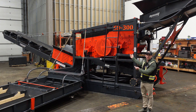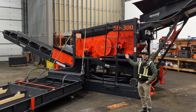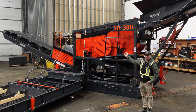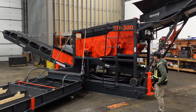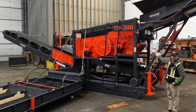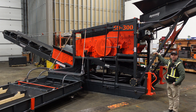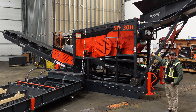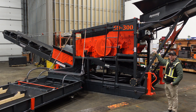With that dual sluice setup, the tailings conveyor is an option you need to go with to remove those coarse tailings away from the plant. This setup is on skids. It has a three by eight foot shaker deck. It's the double deck, so there's a polyurethane screen media on the lower deck and a steel punch plate media on the top deck.